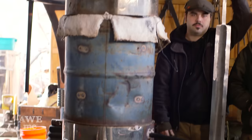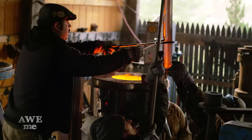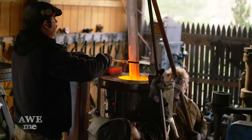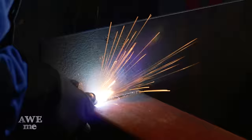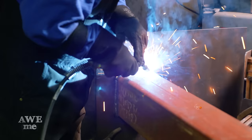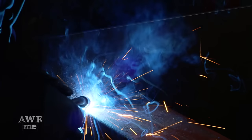The furnace we're using is called a muffle furnace — it's a pipe within a refractory shell that insulates whatever goes into the pipe from direct heat and flame. It keeps a nice, even neutralizing atmosphere. Heat treating this massive sword is the riskiest part of this process. Ilya and Kerry use two supports to raise the blade up and lower it into the forge. The Berserk Dragon Slayer sword is so big that we have to fabricate a specialty quench tank for the hardening process. John, our head welder, is fabricating that from a piece of six inch square structural tubing.